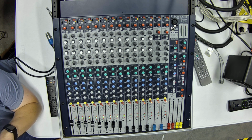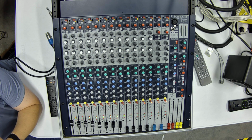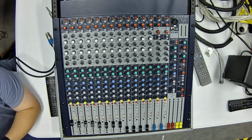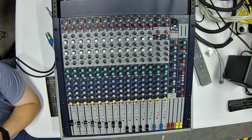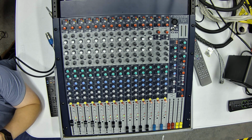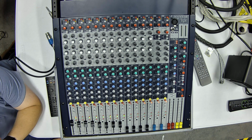And so we tend to describe that wave process of that increase, that boost, that peak, as a positive pulse. And then that drop as a negative pulse. Because that's what happens with the magnet in the loudspeaker, is you're doing a positive pulse and that pushes it out. You do a negative pulse and it pulls it back. And it just does that fast enough and it starts moving the air and making sound. Okay? So you have positive and negative pulses. We refer to that as the polarity.